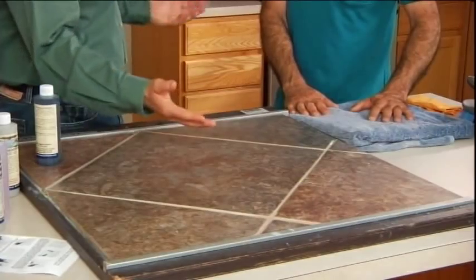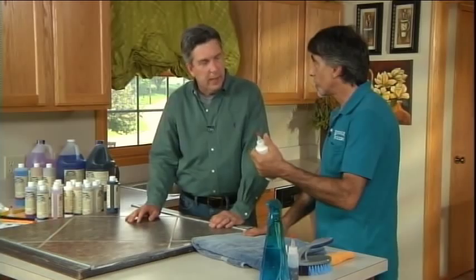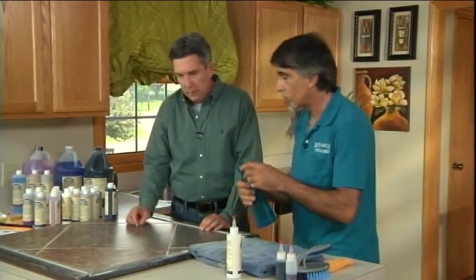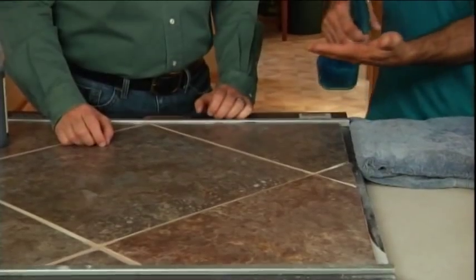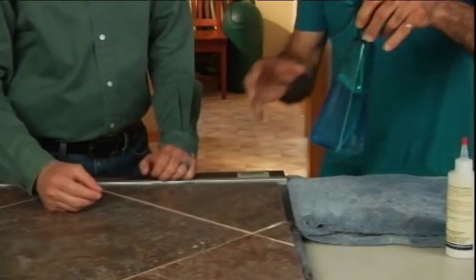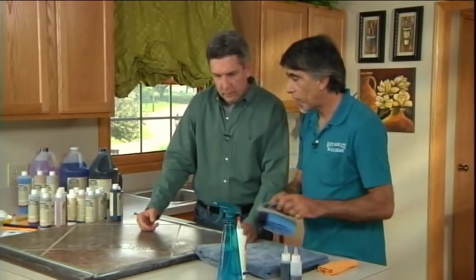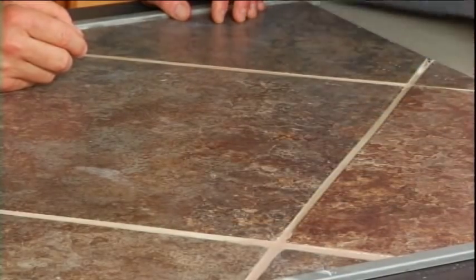What can I use to make this an easier, simpler project? There's an acrylic resin. It doesn't bond to the tile — it bonds to the grout. With any kit, that blue bottle is a deep cleaner. You dilute it, put it in your own squirt bottle, and just spray the tile. Everything is water-based and biodegradable — it will not hurt you. The deep cleaner removes any oil or soap from the grout joint, opening the pores for the resin to bond. Once you spray it, let it set two to three minutes, lightly scrub it, then dry it with a towel. You're ready to apply your product.